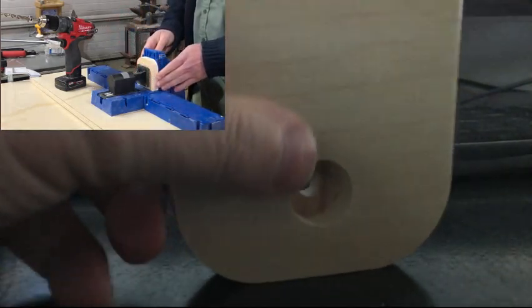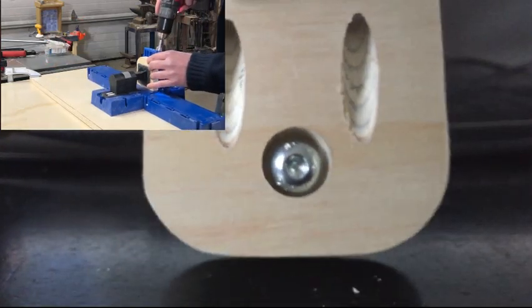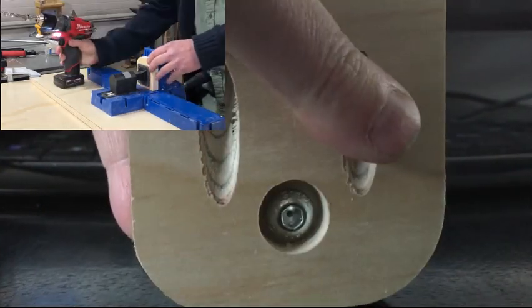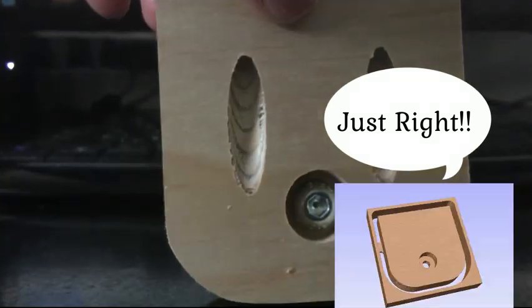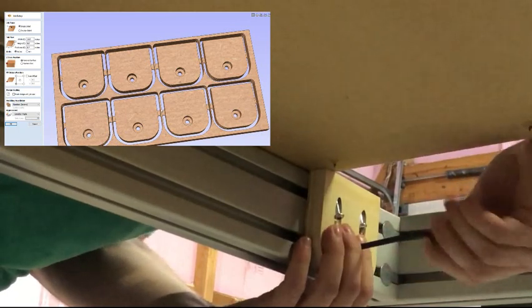You can see how it turned out. You see it here without the Kreg holes in it. The 3.25 inch width is the same size as a Kreg jig, so it's very easy to line it up with the Kreg jig and just drill the two outside holes. As you can see, the screw in this version moves in and out with just a small amount of friction — it's very nice while attaching to the T-nut. You can make them one at a time in about a minute and twenty seconds, or do eight at a time.